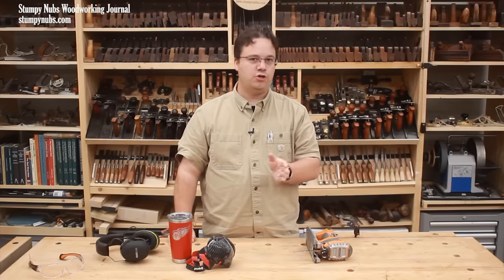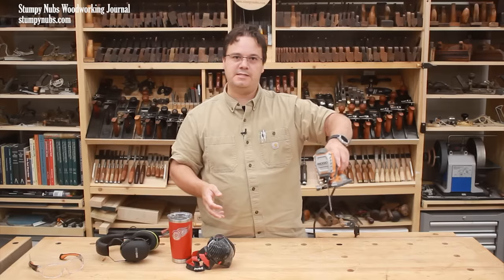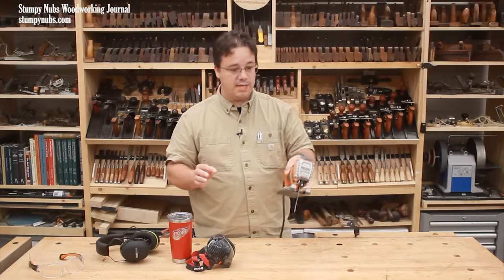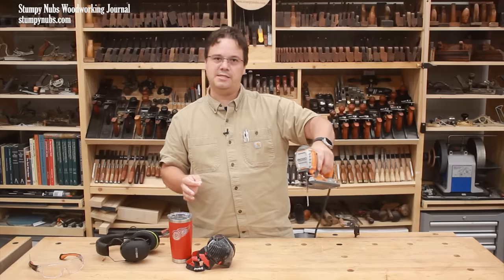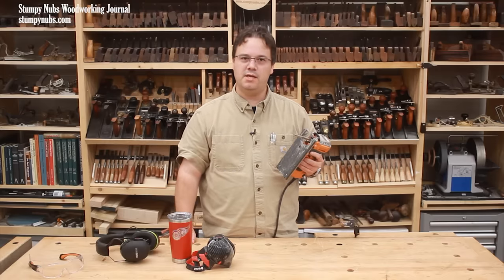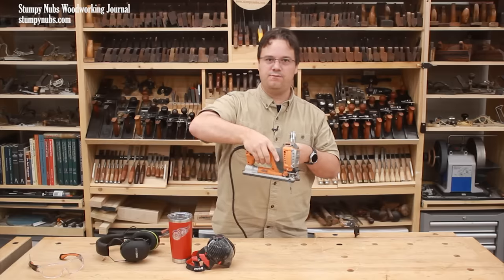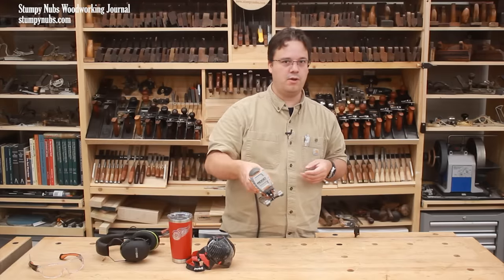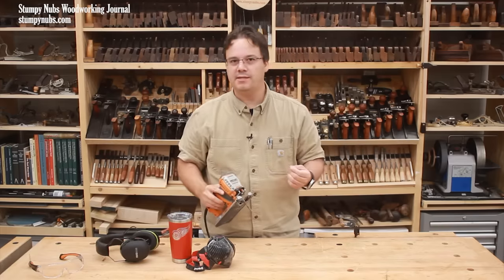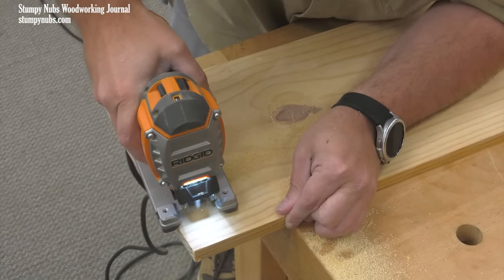Deflection is most common during curved cuts because folks tend to steer the saw by moving it sideways. Examine your technique closely — you might find that even though you're rotating your saw as you go around the curve, you're still pushing it to the side. Another cause is a misunderstanding of where the pivot point of the saw is. It should turn at the front of the blade, not at the center of the base. You don't twist the whole saw to go around a curve — you pivot at the front and let the back follow the blade, keeping your eye fixed on the front where the cutting occurs.